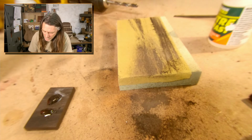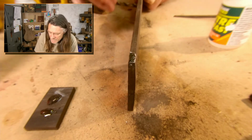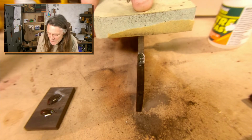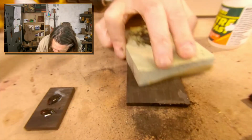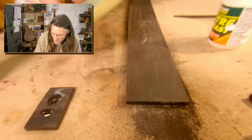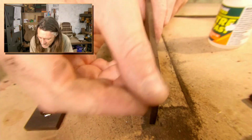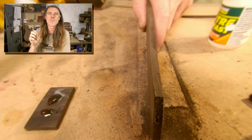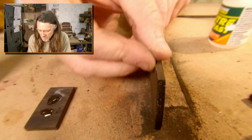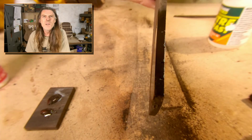which was just black super glue. I think the advantage of the black super glue is it's consistent, so it's always the same colour. When you make up a paste, like your wood dust, you can guarantee that you won't quite fill it and you'll have to do it a bit more, and then you can never mix up exactly the same colour again. So that's why black super glue is really, really handy. So there you go, that little chip pretty much vanished.